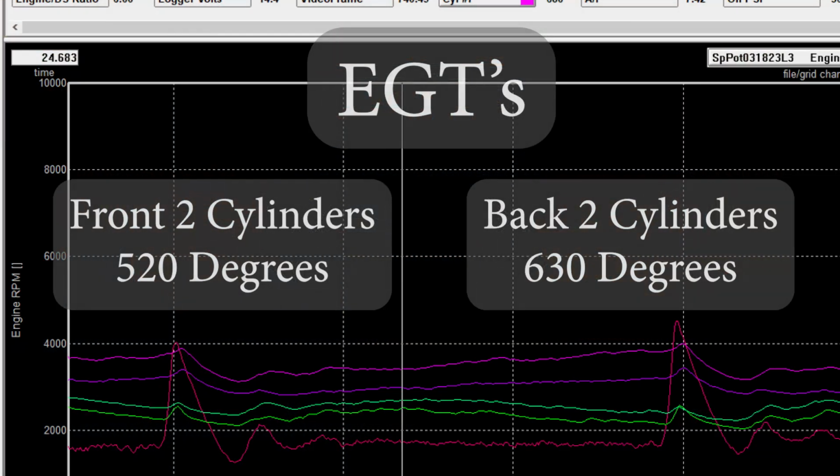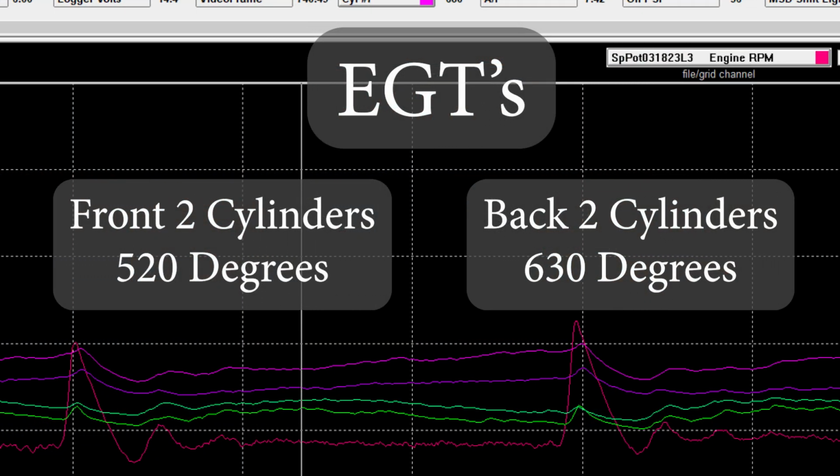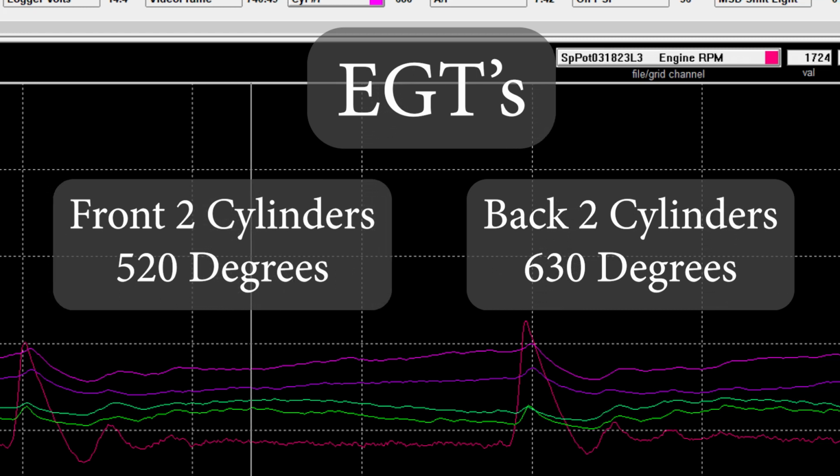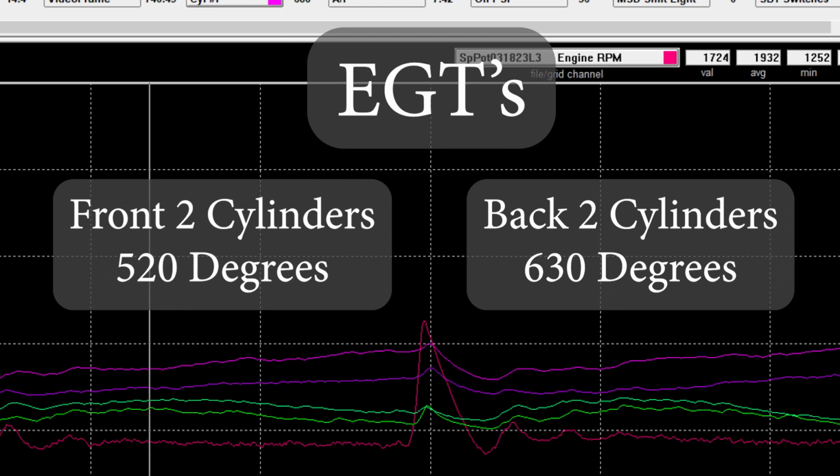But we leaned it out by 4 flats and then fired it again, and I had a bunch of blower surge, which sounded cool as hell. It did sound pretty bad. That was awesome. We went live on TikTok, Facebook, and YouTube. Find us on all those platforms. A guy in there, last name French, I don't know if that's real or not, but he was thinking it may have been too lean. So we went ahead and went 2 flats back, and the blower surge definitely sounded a lot better. It did not fumigate the entire barn, so we were thinking in that sweet spot. I locked it down there. That was that last fire, that's what I did.